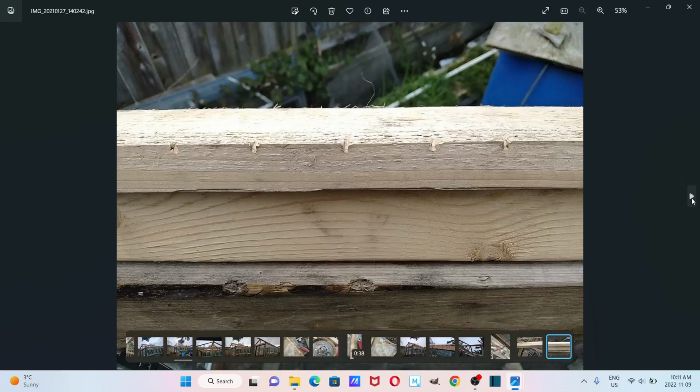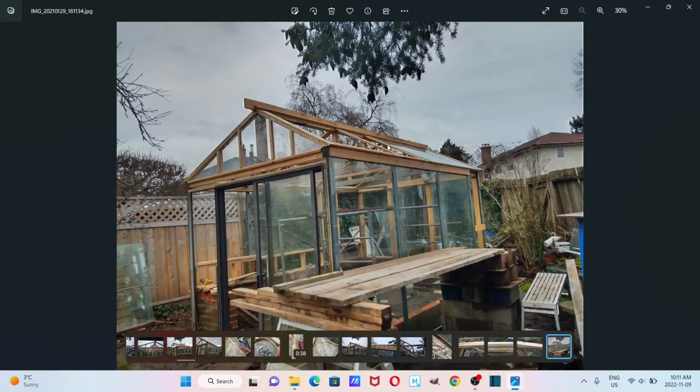And I cut little cuts on the wood, because silicone rubber sticks well to glass, but it doesn't stick that well to wood. So if I have these little notches on it, when the silicone loosens off the wood, it's not ever going to slide down. It's going to have these little grips. So I put the grips all over the place. And when I put the glass on, I put the silicone in from underneath, along the grips.